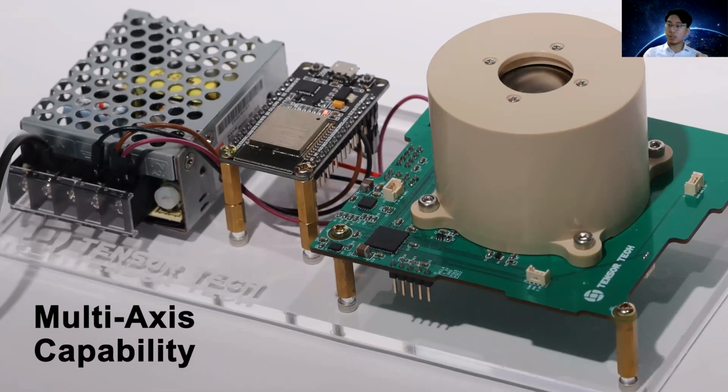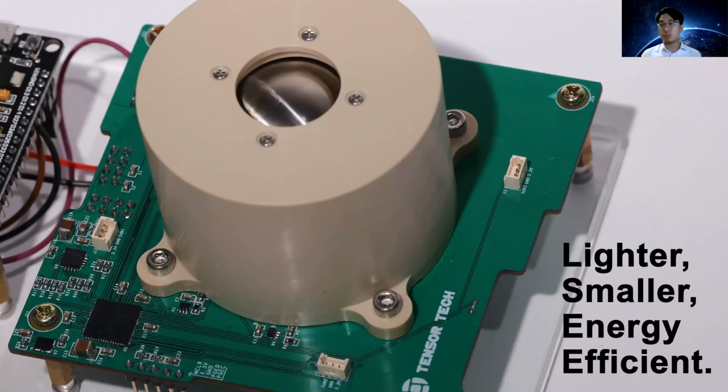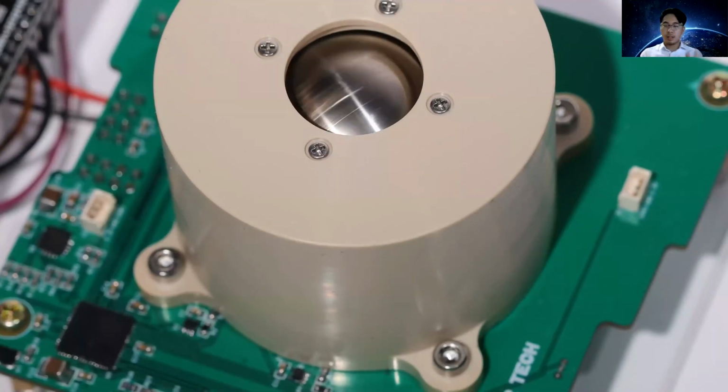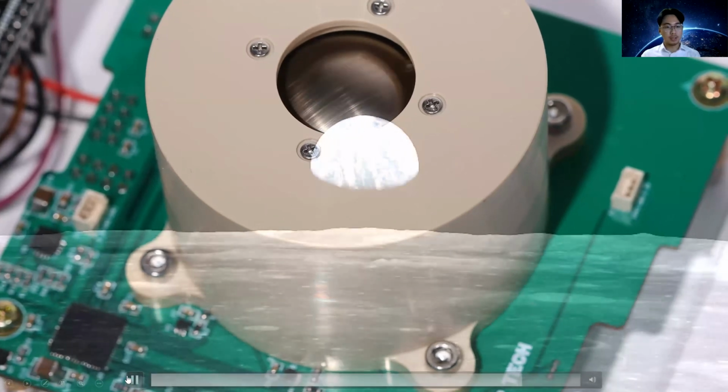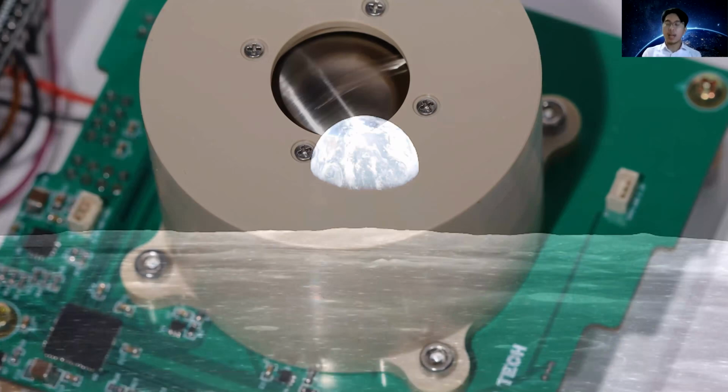This is called our RS100 product, which stands for a reaction sphere capable of providing angular momentum storage capacity of up to 10 millinewton meter seconds. Plus, to save our customers the trouble, we also provide an attitude control system, which is an integrated solution combining fine sun sensors, magnetometers, and a gyroscope, as well as, most importantly, the attitude control algorithms. So our customers are able to just input the attitude command without thinking about how to build the algorithm inside this complicated integrated system.